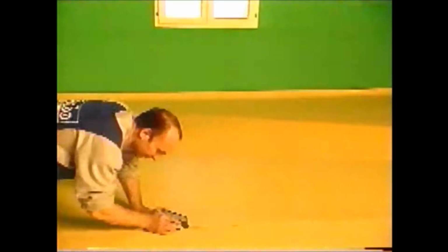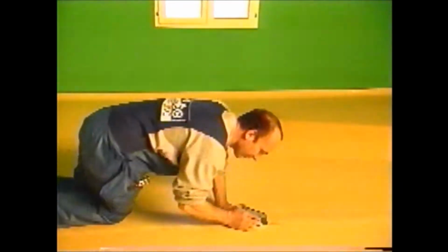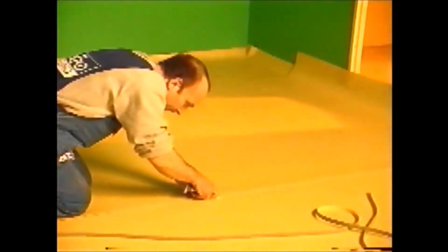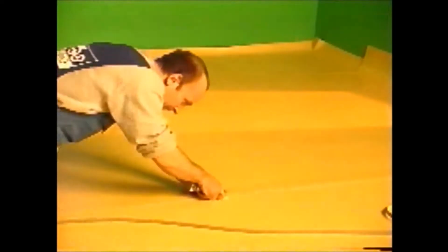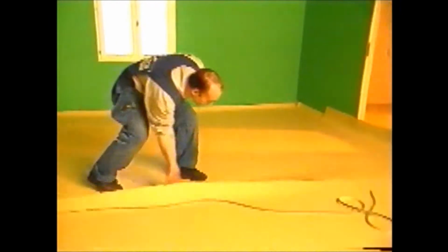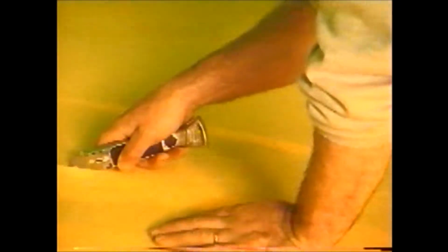The seam is made by cutting through the 2 overlapping selvages in the case of easy-cut floorings. With others that are harder to cut, cut off a 2 to 3 centimeter selvage with a band cutter, then overlay the previous length by 2 to 3 centimeters, and cut the second length using the first length as a guide. Once the seams are made, the 2 borders are trimmed.